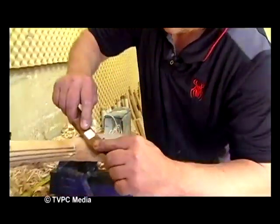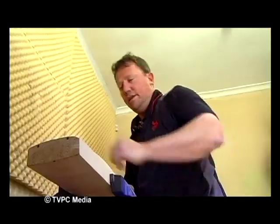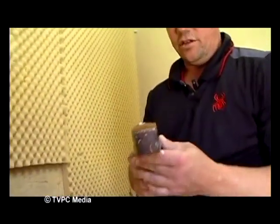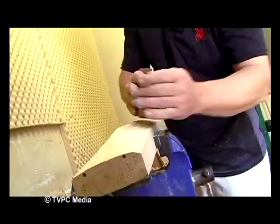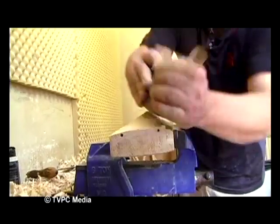The shoulders are finished off with spoke shaves, after which the bat is sanded down again to give the handle a really nice feel. The next important tool is the old box plane, which has been converted to a rounded face to get a scoop going out the back of the bat. The reason for this is that some players now want to leave a thicker edge, and the wood has to be removed somewhere. You can see it starting to create a slight curvature as it continues to shape the bat more and more.